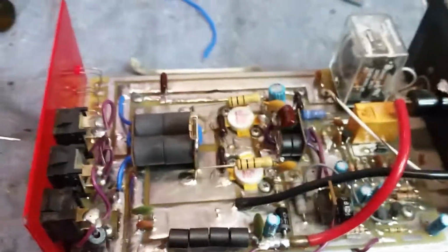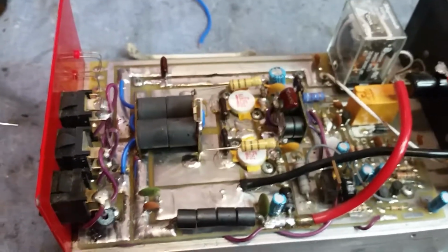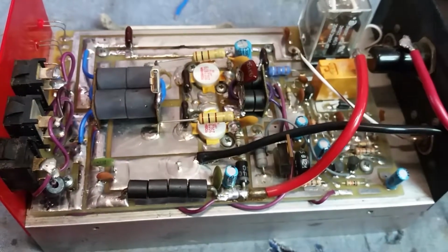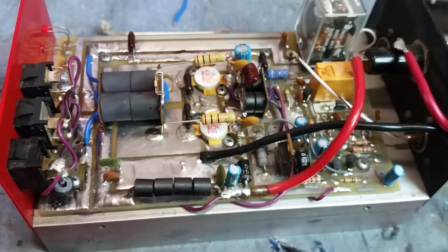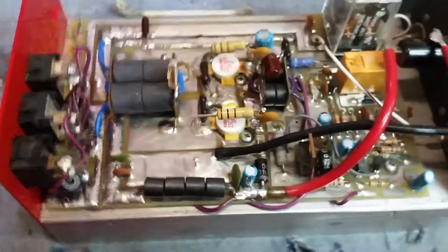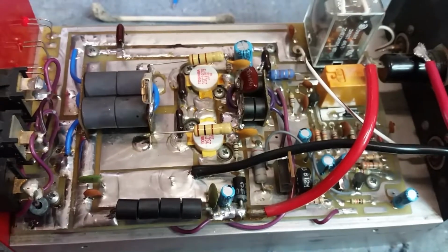But that was not the only issue. After I got that and actually got the thing, see, I couldn't read what you had put on the top. It almost seemed like you said it would not do wattage until unkeyed, which I didn't think so. I was thinking maybe you keyed and it wasn't doing nothing. When you unkeyed, it started oscillating. I've had amps do that before. You key, try to talk, it's not doing nothing. As soon as you let go of the key, it goes into full oscillation, and the amp stays keyed up. But I think every time I've had that happen, it was doing power the whole time. It just wasn't unkeyed. But I didn't see that happening with it, so I don't know what that was about.